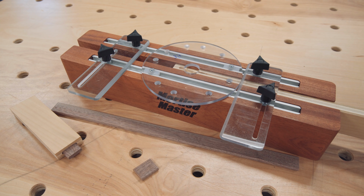But if you have a vise, a very fast way to batch out a lot of these is to just use your vise in conjunction with these plates, if possible. What I mean by that is, in my particular setup, completely unplanned but really cool, this can set in place so that you can swap material in and out, get the next piece in, lined up with that center line, lock it down with your vise, make your cut, batch everything out pretty quick without having to move the jig, and yeah, very, very fast and convenient if you have a vise with the jaws that'll accommodate this.